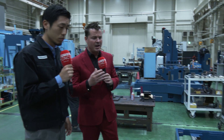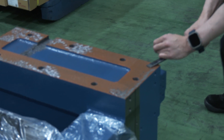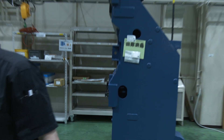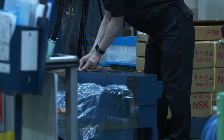To put it simply for some of the audience watching right now — what we're talking about is the material is sitting flat. We think it's already darn near perfect, but there's going to be deflection in heavy parts, which is this big heavy piece right here. That piece gets put on and off with hand scraping in between to adapt to all of that deflection in the part. Right? Yeah.